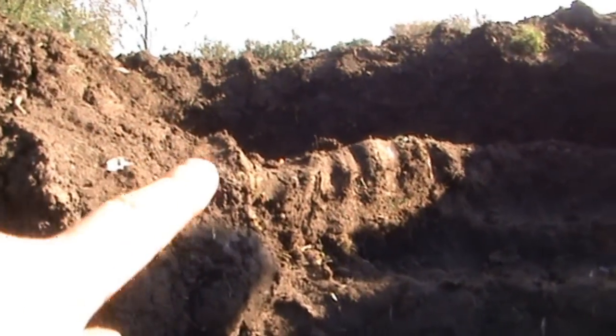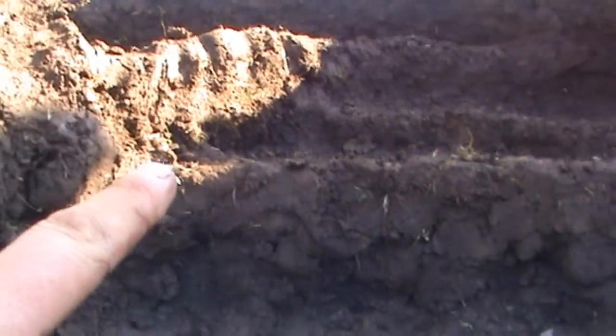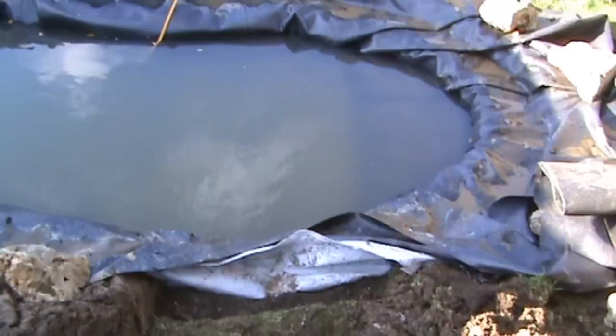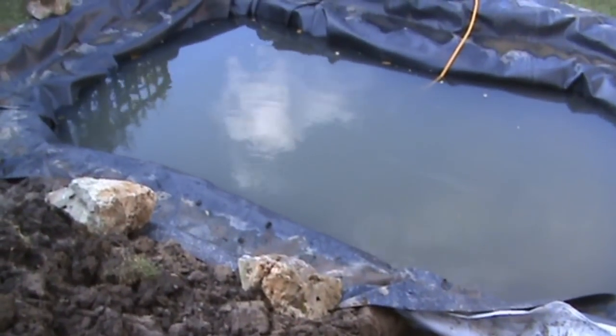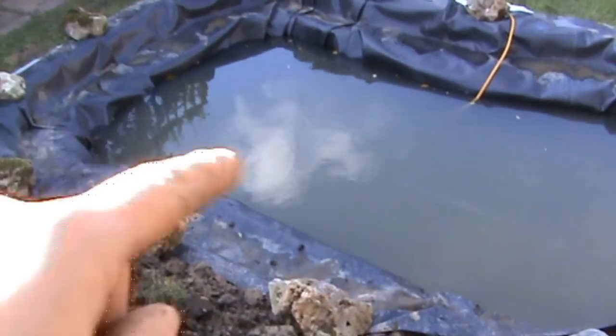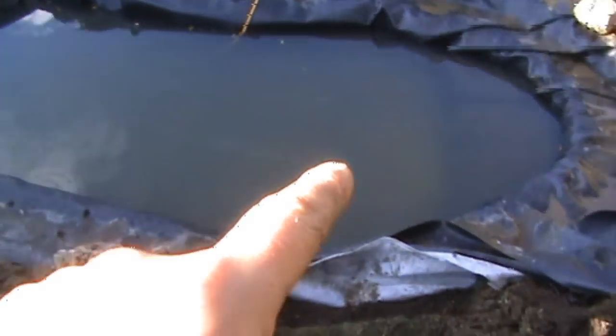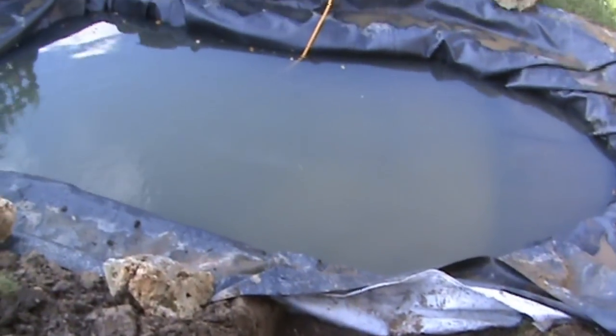The important thing to note is the height of these sides — much higher than where the water is going to be. Notice that on both sides, way higher than where the water is going to be. So you're going to have your water coming over here, and over here. The liner will go right up these sides and even with a bit of splashing there's no way the water can leak. Looking down, the water is going to come over here, drop, turn 45 degrees, drop down a series of steps, and back to the shallow end of the pond. It's quite important that it's going to the shallow end, because in the winter your fish are going to hibernate in that deep bit and they'll be reasonably warm there. If your pump is in the deep end it pumps the warm water out, chills it, then it freezes the pond and knackers the fish. So in the winter, instead of the pump being down in the deep end, you can move it into the shallow end to just circulate clean water, keep the filter alive, and most importantly keep the fish alive as well.